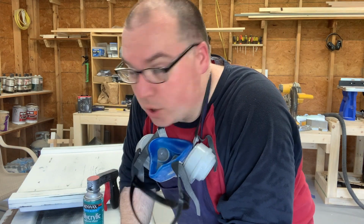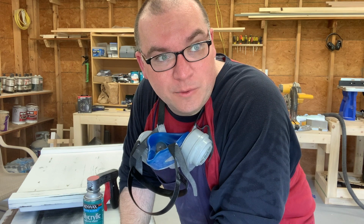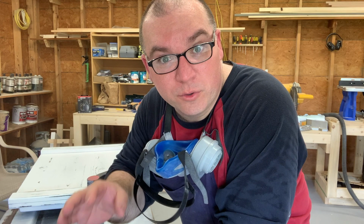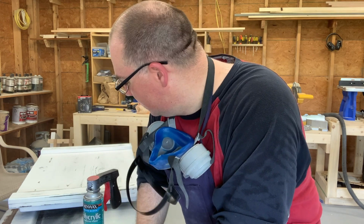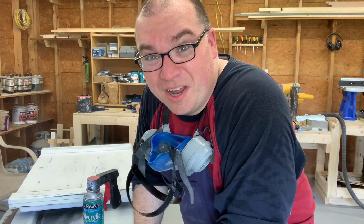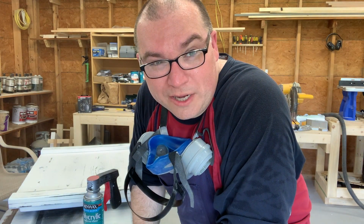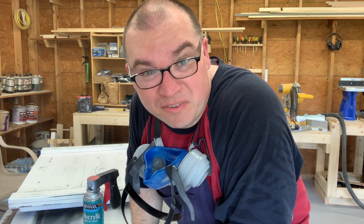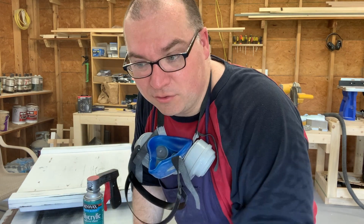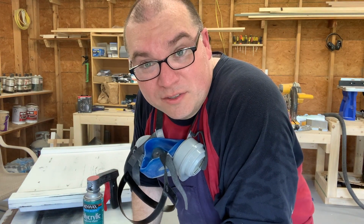And that has it for the first coat. I'll make probably 3 coats over that, and then I will do a light sanding and finish it with a light coat of clear coat for 4 coats total. But the first 3 coats will go pretty quick. This stuff dries really fast, especially as hot as it is in here. So then I'll probably wait an hour or so to do the final coat, because I want to make sure it's dried really good before I sand it and do the final coat. So I'm just going to do about 2 more coats of this.